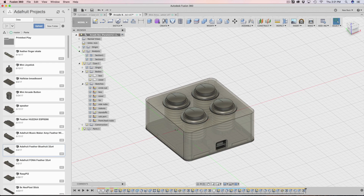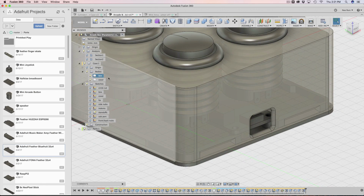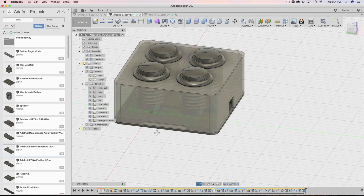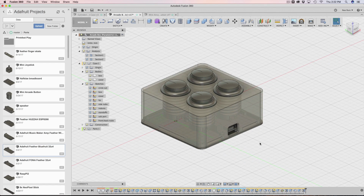If you think a sweeping thing would work better, like if I just swept this along, I'll have to reiterate that did not work for me. That's what I tried at first. I just had this nub sweep across this entire thing. But when I printed it, when it scales large, it no longer works. It's a very strange thing. I'll have to share it on one of the 3D Hangout shows. How as you scale this design, it's actually better that you have more points of friction. So that's why this isn't just all swept as one giant nub and one giant lip inset. So just thought I'd throw that out there. I did try it and it didn't work. So I would love to know any alternatives, but maybe it's overcomplicating it. I would love to simplify this even more.